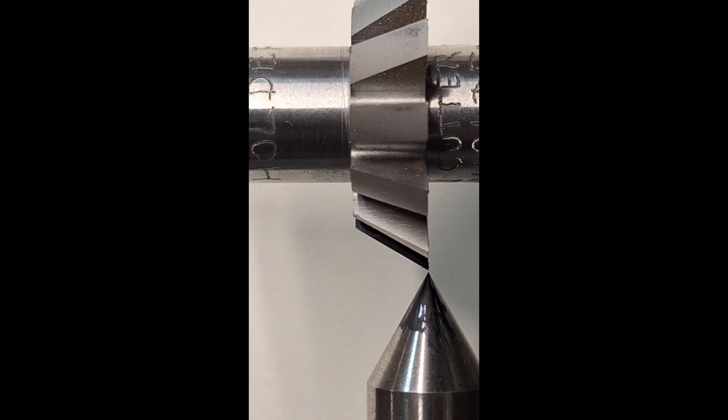With a conventional tooth profile you would be lining up so that the centre of that profile is in line with the centre, and as I said you can use a V rather than the centre to help with that process. But for a 60 degree cutter like this where you have one flat face, this I find is as good a way of centering as any. I'll lock the head off and then find the correct height for the cutter in relation to the job, because I'm actually going to do the cut with the cutter traversed forward some seven millimetres — to compensate for the 60 degree angle, so that the teeth end up equally disposed about a centre line rather than angled over.